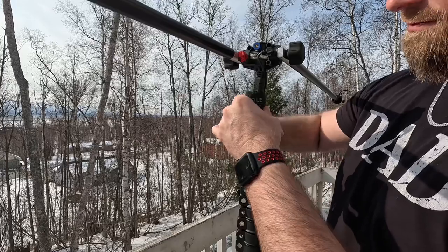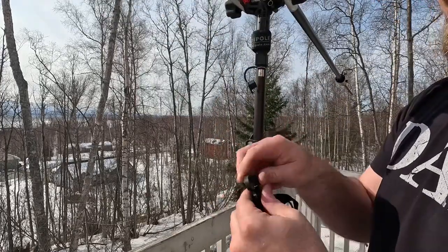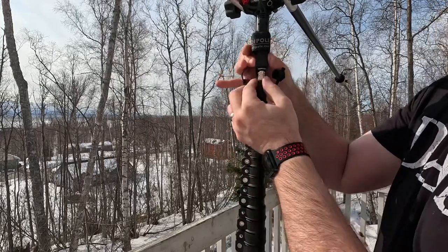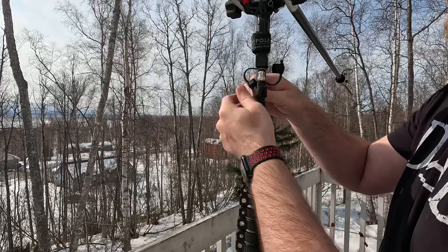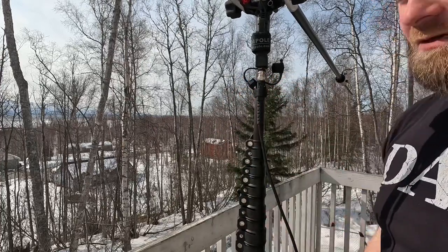Use the strain relief — we'll do enough to secure the connection on the telescoping mast. On the coax, I have another strain relief I like to use. Connect this BNC connector, I want to do another wrap. Alright, now we're ready to tune the antenna.